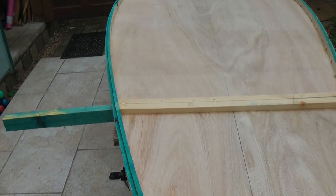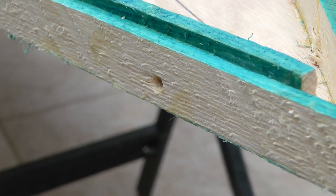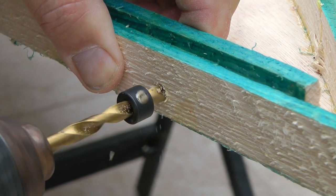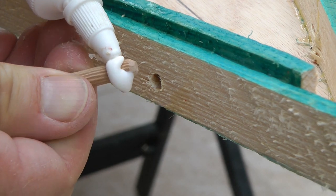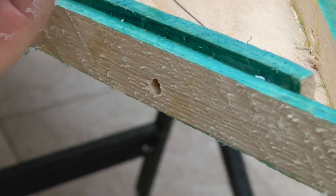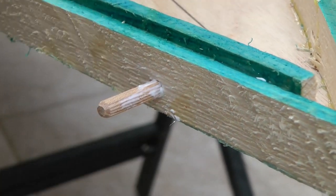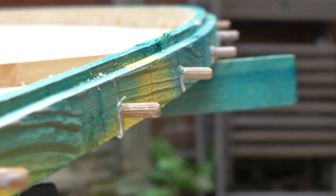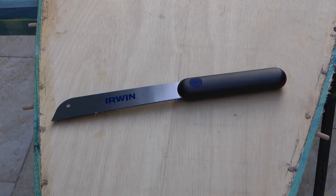So that's the base — now it's got two strips on it. You just add another strip on top and again when the glue is dry take the screws out and drill it out. It gets easier though because I'm on to a six-millimeter drill and shop-bought fluted dowels from Toolstation, which were I think three pounds fifty for two hundred — so really cheap and quite easy.